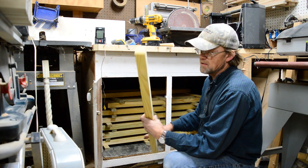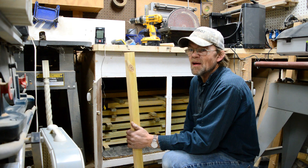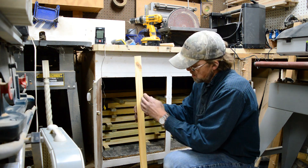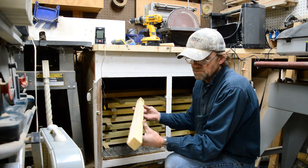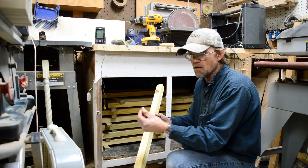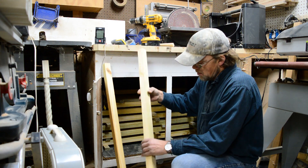I'm gonna go ahead and unload this — I've got 40 blanks in there, and they're fixing to be cut into spindles. The last load I did, I put in about 50 and had 10 come out bad — they cracked and warped. But overall, going from 20 to 30 percent moisture down to five to seven percent is pretty good. You can feel it — this feels dry, versus when I put it in, you could rub your hand across it and get moisture on your hand.